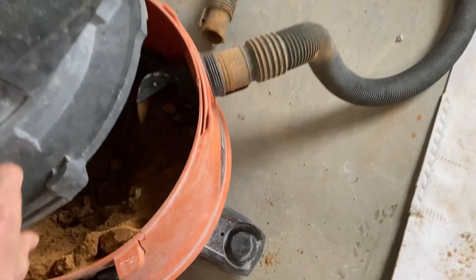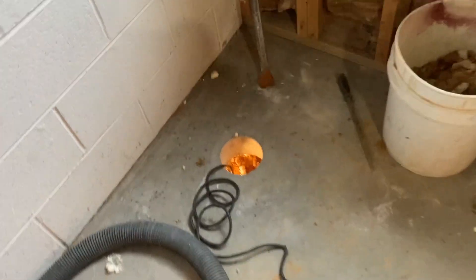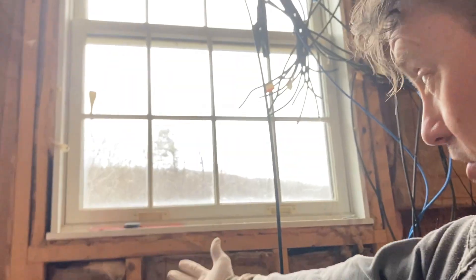What I was preparing to do was make this the new suction point and route the pipe in here, then excavate the heck out of it. When you excavate it reveals stuff — I pulled about two and a half of these buckets out of this pit. If you've seen my videos on external sub-slab depressurization jobs, the pipe coming in from outside goes through cinder block, which is hollow. If you're not careful and don't seal that, you'll lose suction within the cavities of the cinder block — and that's precisely what happened here. I've already repaired it with expanding foam.